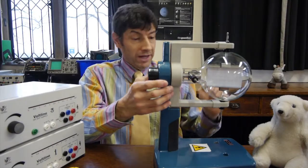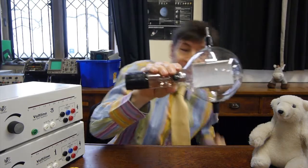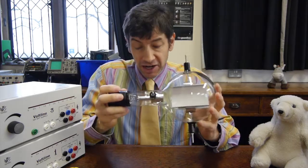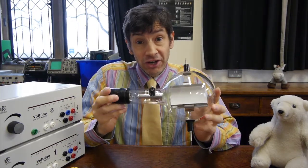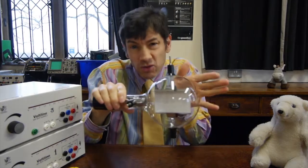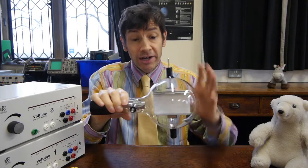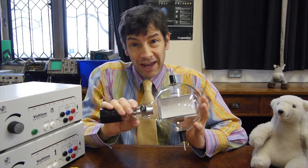Let's have a look at the apparatus we've got here. It looks a bit complicated, so I'm going to take the important bit out of the stand. This is an evacuated glass tube — there's a vacuum in it. In this end there's an electron gun that's going to accelerate electrons across the tube. You might have seen my video on the electron gun; if not, perhaps have a look at that. We're going to wire this up, get a beam of electrons going across the tube. They'll hit this fluorescent screen and produce a line of light showing where they're hitting it. And then we're going to see what happens when we put an electric field inside the vacuum of this tube and see what happens to the direction the electron beam takes.